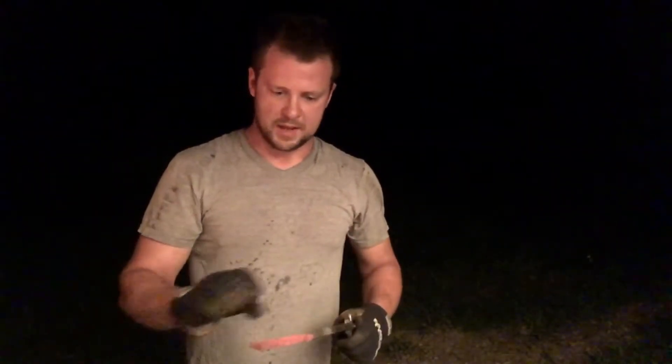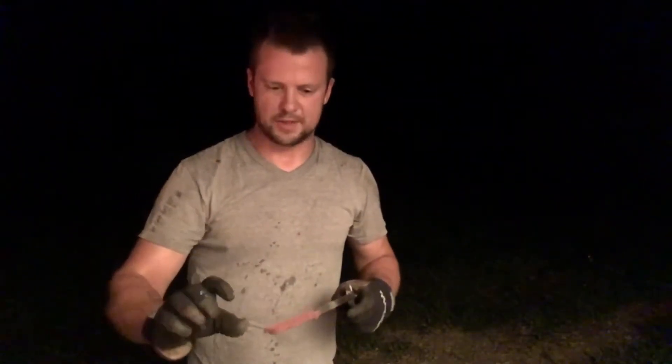Right now I try to get it as straight as I can. This piece here is forge welded, ready to be drawn down. What I've read and learned is it's very difficult to forge weld two pieces of metal together that have scale on them. They don't really want to stick all that well and you won't get a real clean weld. So this piece here is going to go to the side, cool on its own, and I'm going to get the next one to fire.